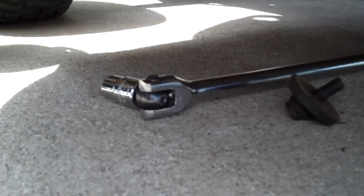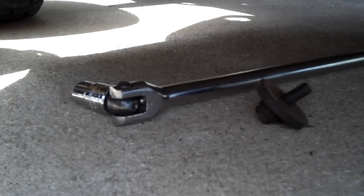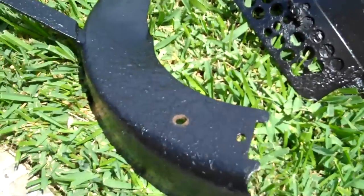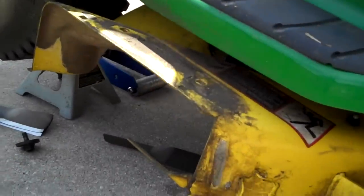I've removed the one blade — it was a 14mm, turned it counterclockwise with a nice big breaker bar, which makes things a little easier. Moving on to the next blade. Two of the parts that are going to come with your mulching kit are this deflector plate and this little side discharge block-off plate.